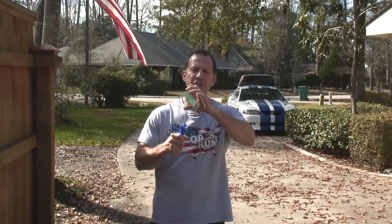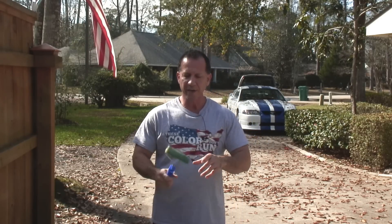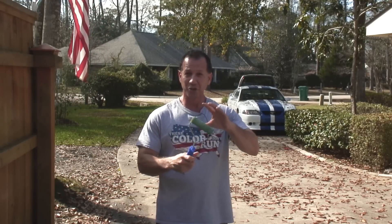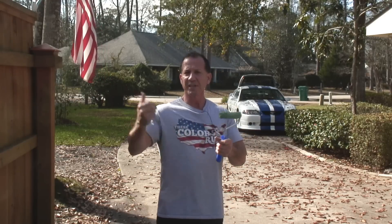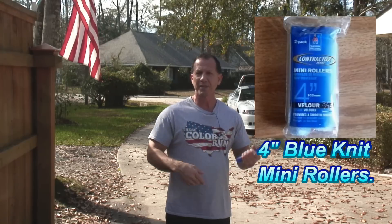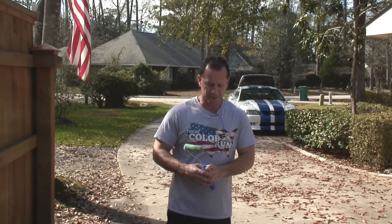You don't have to clean the roller off every time. It has a little bit of paint on there — you just don't want it loaded up with paint where it's going to show roller marks. You want this to be fine when you roll. Do not take a lunch break and then come back expecting to use it like that, because it'll dry out and you'll really mess it up. So it's good to have a couple of these little rollers around. When it starts getting dry, pop another one on. Put the used one in a bucket of water to clean — it only takes a couple of minutes.